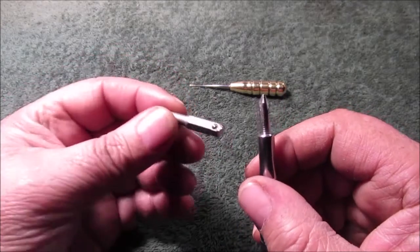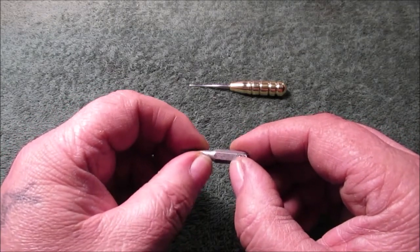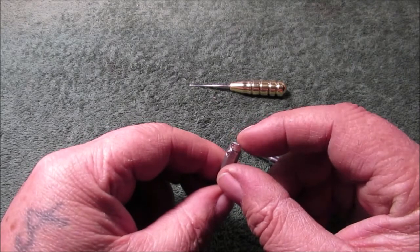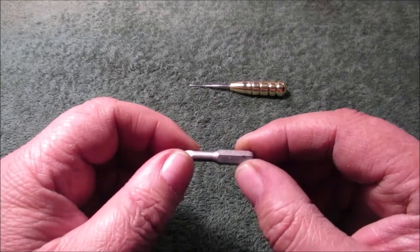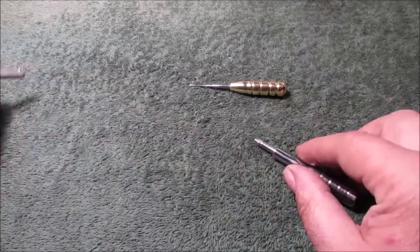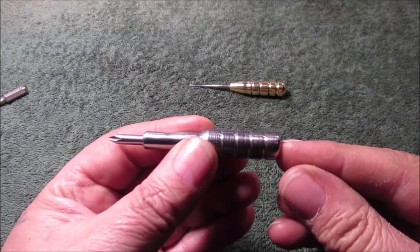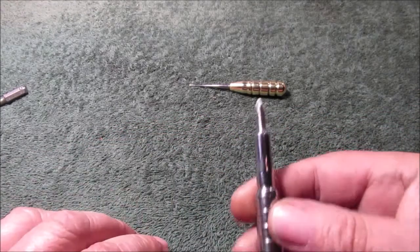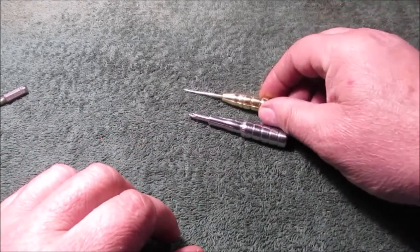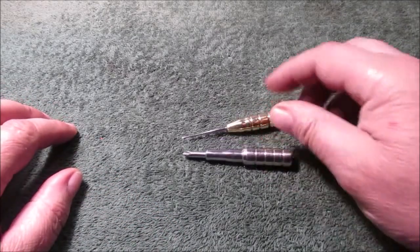I cut it off and ground the tip with my diamond wheel on my little sewing machine grinder. I can't believe I hacksawed through it — it took a while with a Lennox blade since it's pretty hard steel. I ground this part down to about 3/16, which was bigger than the shank, then put it in the vise and pressed it. I have copper jaws so the tip was embedded in the copper and the shank pressed against the other jaw to seat it. I don't think there are too many screws. I may make a straight one — I did find a piece of metal for it.